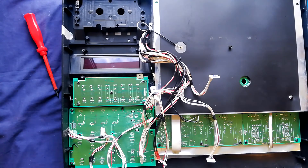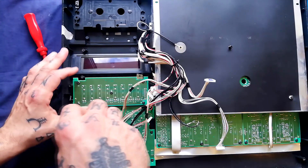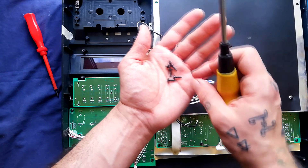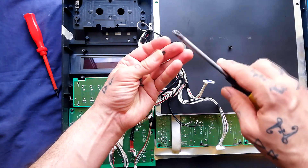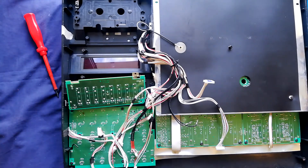That tab is the way the shielding behind the display and this piece of metal shielding are connected to each other. Generally speaking, anything that's like a heat sink or shielding should all be connected somehow to common ground in the circuit. A system of tabs and ring connectors like this is usually how it's achieved. These screws are about 15 millimeters long with a wide gap between the ferrules — about a three-millimeter diameter on the shaft including the ferrule itself. They accept a standard Phillips head screwdriver, and so far I haven't had to use any other size on this project, which is nice.